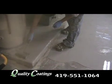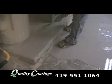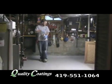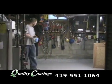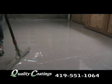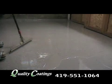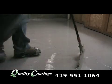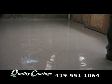The edges are hand brushed, so this is quality coatings. We're not getting it up on the wall. We're hand edging all the edges, and then we have smaller rollers to get in the tight areas. While the material is still wet, we broadcast the vinyl chips into that, and we have special cleats that suspend us from the material and just leave little pinholes, and the epoxy has that self-leveling ability, so the pinholes will close rather than having your footprints be a little harder to cover up.